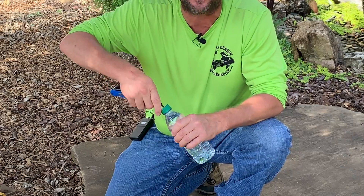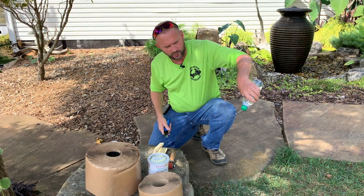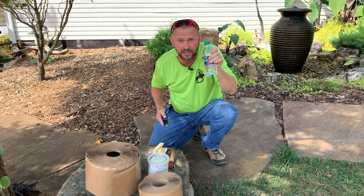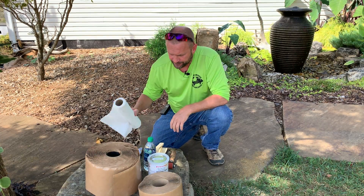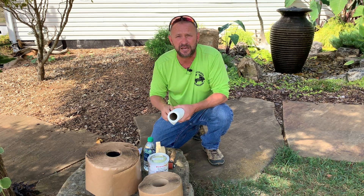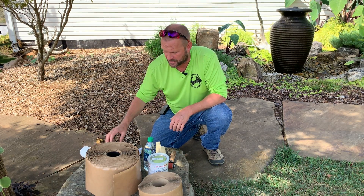These are our basic tools. When we're washing, we've got water bottles on site and we want to clean with clean water. We take our razor blade knife and make a few holes in the bottle — that's our professional pond cleaning tool. Clean it with that, scrub it with the scrubber, water, scrub, water, then wipe it down with your towels until the towels come up clean. If you're still getting mud when wiping with clean water, you're not done — get the liner 100% clean.